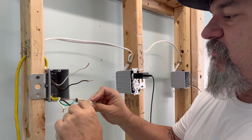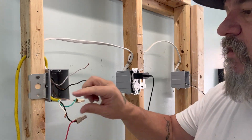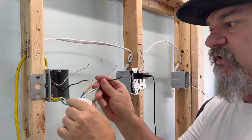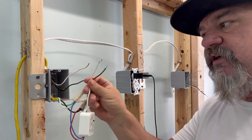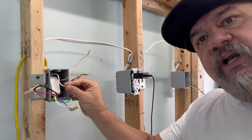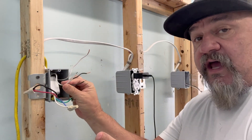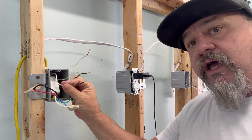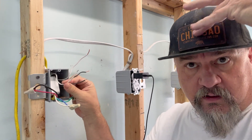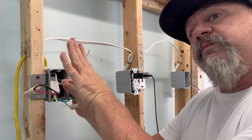I found mine — my red to black, just like it's set on the receiver, nothing to it. Then my blue is my neutral, and then this would go to the light fixture. If this was a round box going into a light box, you'd stuff it in inside the fixture itself, put your light on there, and keep it there. We're just doing this differently because I don't happen to have a round light fixture on me. Spur of the moment — see the dirty working hat.